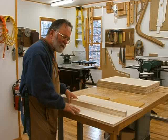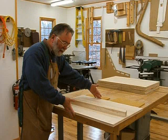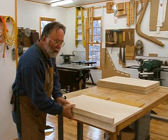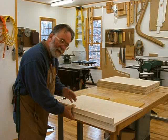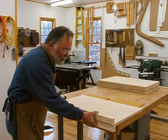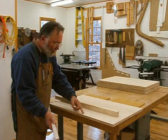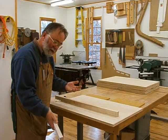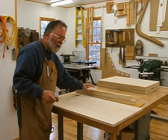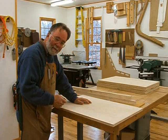Here I have the dust dividers, and they're going to be sandwiched between the sides. The way they connect to the sides is through these drawer slides — actually drawer slides on the top and bottom. They will not only guide the drawers, but they'll also have holes drilled in them so I can attach them to the vertical plywood sides. I'll glue that surface and also drill up through the bottom with four or five screws to clamp this onto the dust divider with glue. So I need to mark where I don't want any finish, because I finish my work as much as possible before assembly. I've got the marking gauge set to seven-eighths of an inch — these are one-inch thick drawer slides. If I make a mark at seven-eighths and don't put any finish outside of that mark, I'll be okay for gluing later on.